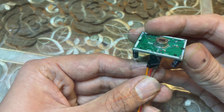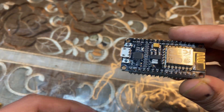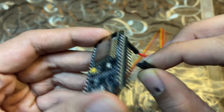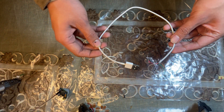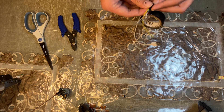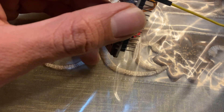After connecting the wires, place the PIR sensor cap back on. Then take your ESP8266 and connect the other end of the jumper wires to it. PIR signal pin will be D1 on the ESP8266, ground will be ground, and the power pin — make sure to connect it to 3 volts, not 5 volts. To power everything up, connect two female ends of jumper wires to your USB cable, positive to the VIN pin on the ESP8266 and ground to ground.